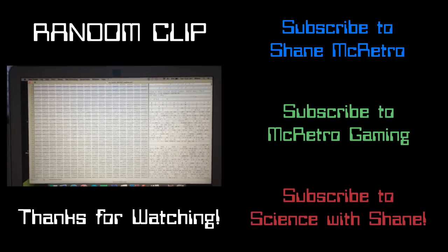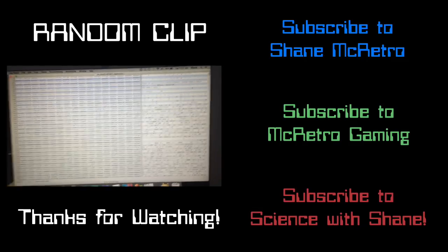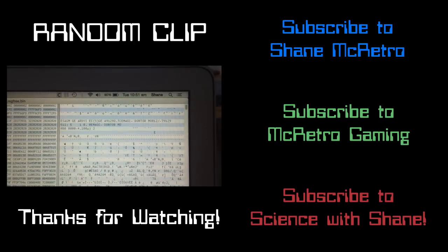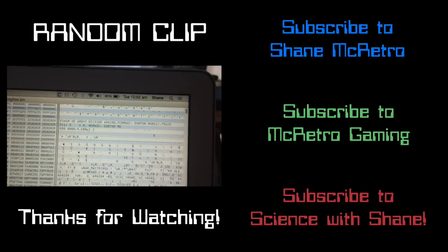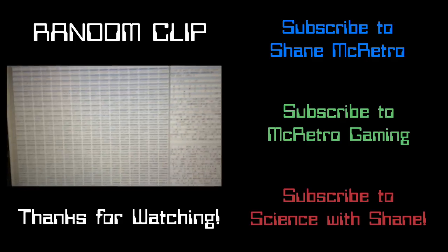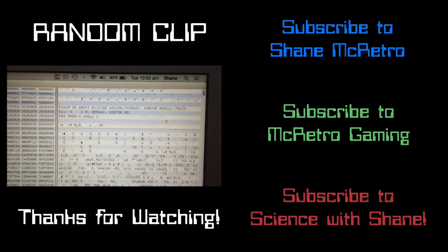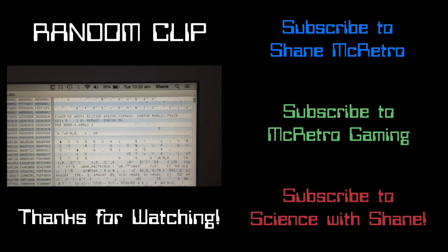Actually, I might as well show you the code itself. So this is what I needed to put on the chip. At the moment it's byte-swapped, so if you reverse those letters around you get Sega Mega Drive copyright, blah blah blah — dates. A new chip, maybe this one after. As you can see, those two are now identical.